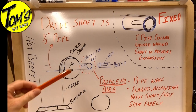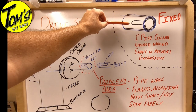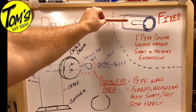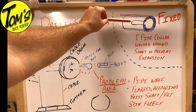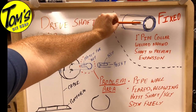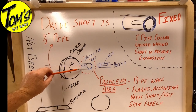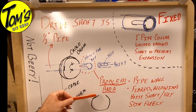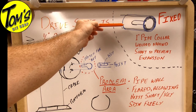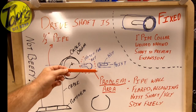To fix that, there is now a steel collar — this is a one-inch pipe, and I took a piece of inch-and-a-quarter or inch-and-a-half pipe and welded it around the outside of the one-inch pipe. I'm capturing the key, and what that does is eliminate this from happening because it does not allow the metal in the one-inch pipe to deform and release the key. Original design — not beefy. New design — beefier. It'll keep this incident from happening again.